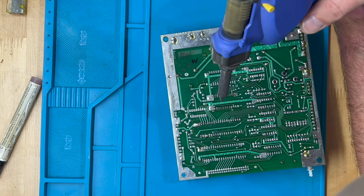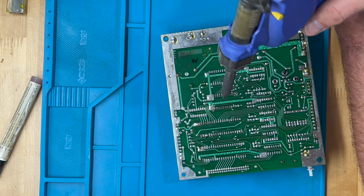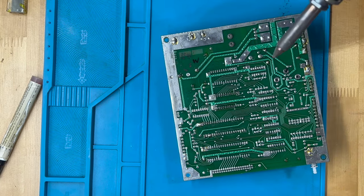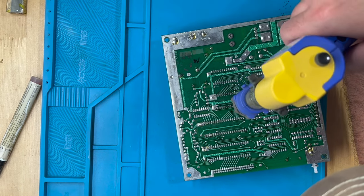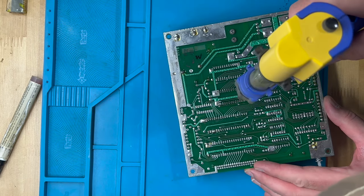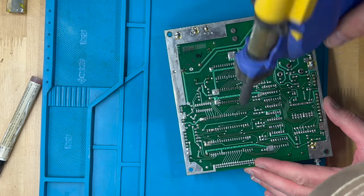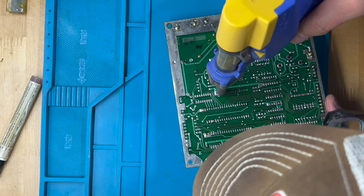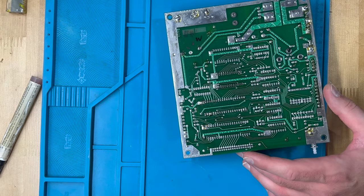One thing I've learned: when you're pumping the solder off, don't let go of the trigger and turn off the pump as soon as you lift away. Pull away and hold onto that trigger for another half a second so all of the liquid solder in the tube will actually get pulled into the reservoir — otherwise you can clog up the actual pump. Some of these might have a little bit of solder left holding them on. These are larger pads that soak up a lot more heat. I think I'm about as good as I'm going to get it.